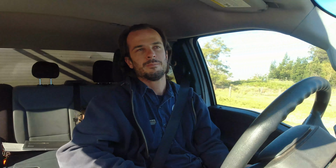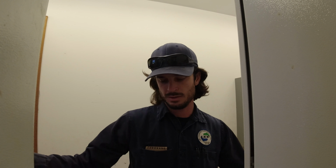All right, well, we're here. Motor's running. And I don't have a decibel meter, and I didn't take a decibel reading when I first installed it, so I don't really have a way of quantifying the noise that the motor's making now compared to some other benchmark of loudness. It does sound loud. The flow is a few gallons less than what it was when we did the startup. What I want to check now is amps and see how that looks, and just make sure volts are good too.